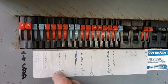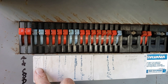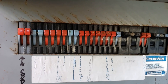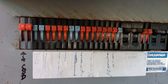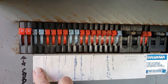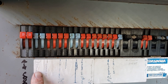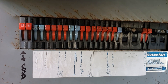Here at the service entrance, you can see we've got 15-amp 220 service going to the garage to power the spa. We also have two individual 20-amp 110 services going to the garage. We'll be replacing those four half slots, or two full slots, with a two-pole breaker to send power over to the new subpanel. The reason the spa only requires 15 amps is that it has a gas heater, and the power is used only for the circulation pumps, not to fire up a heater.